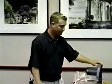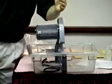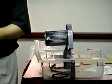If it won't bend back or if it looks like mine, don't fix it — call us, replace it. You're going to take this thing and bend it back the opposite way until it looks straight. We're not going to go five inches like I'm doing here — we're talking a matter of a quarter of an inch. It's not much, but this makes all the difference in the world. A lot of those older Taurus 2s had this problem, and nobody checked. You flip them on, they run great, you get a good five hours out of them, then you're missing a red grommet, then your belt's worn to the side, then your raceway's missing and the blade breaks — and nobody knows why because nobody told them how to fix it.